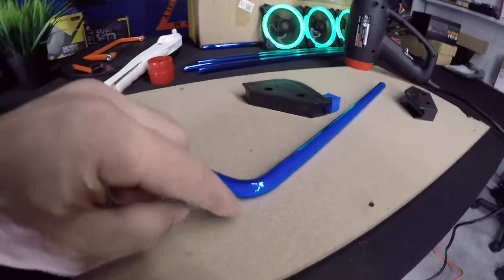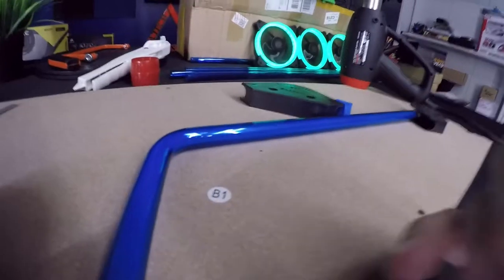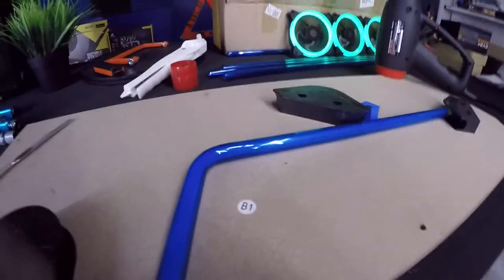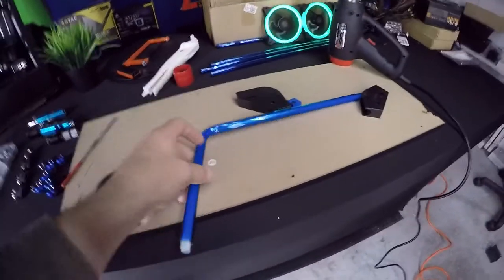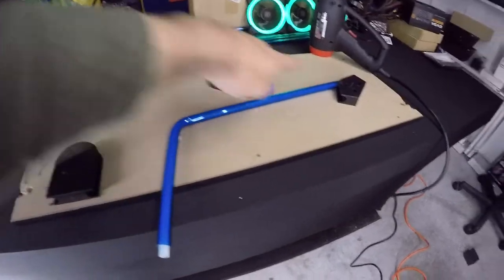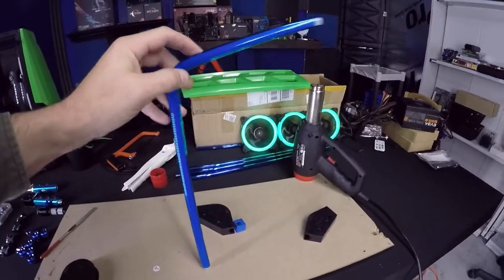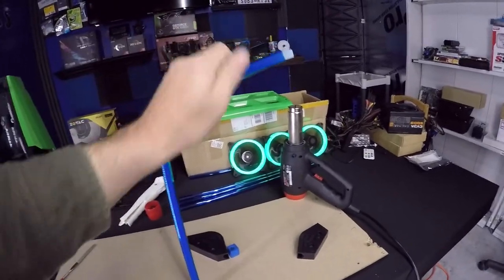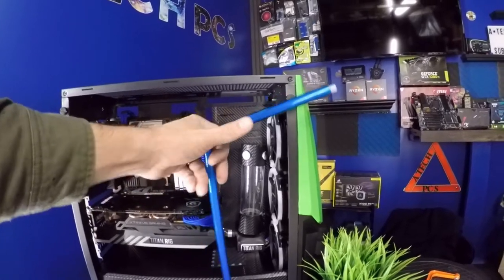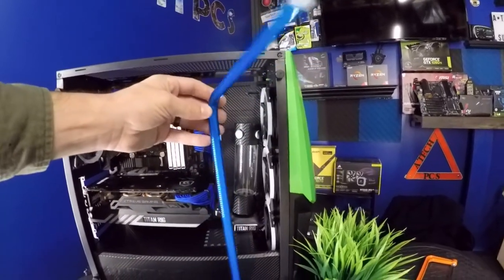You definitely do not want a fat roll. Also if you overheat it too fast you'll get a microscopic heat bubble that builds up inside the plastic. For the core insert, I'll wet it — run some water or saliva on it so it slides in and out of the tube easier. The plan is: the tube bends to the left, then bends upright, and runs to the radiator.